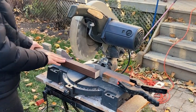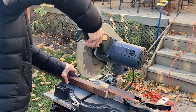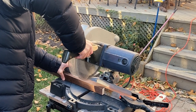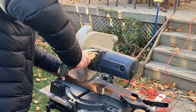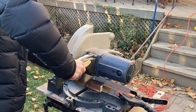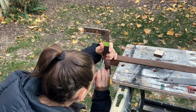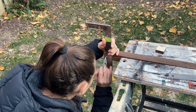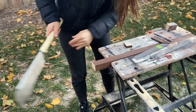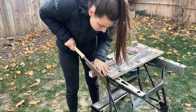After a couple of hours those will be dry and then we can get to cutting. I'm starting with my biggest pieces — I've drawn a line in the right spot on my lumber and clamped a piece of wood here as a guide just to speed things up. For the smaller pieces I couldn't use the miter saw accurately, so I switched to my dozuki, which actually worked way better and was way more satisfying. If I was going to do this again I may have just used the dozuki the whole way through. Measure and mark where you want your cuts and then slice away.